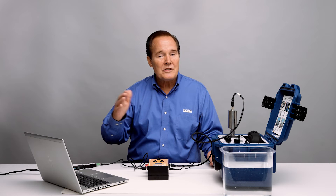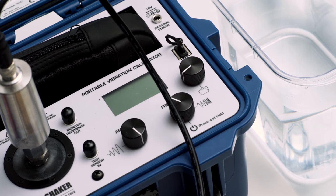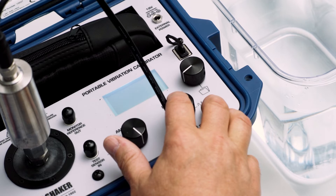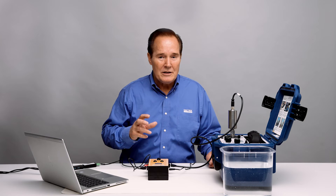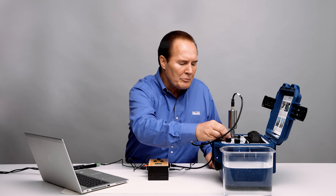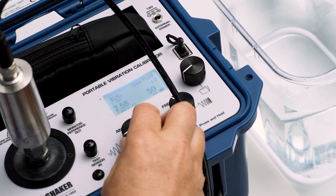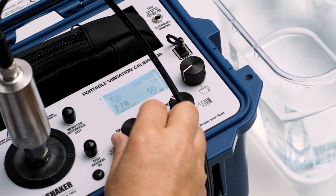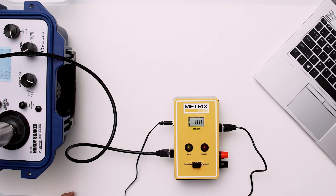Since they're non-latching, when I go below those levels the alarm should clear. I'm going to go over to the transmitter and turn on the HI-903 to demonstrate how this works. I set it up to be at 7 millimeters per second at 50 Hz. Remember we set our alarm at 8, so when I go close to 8 I'll stop it right at 7.9 — you'll see that it's pretty accurate — and we won't go into an alarm state. 7.95. The ST5484E technology is very accurate. There's 7.94, just right on the edge of that alarm — just right below it.